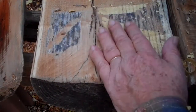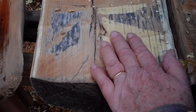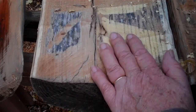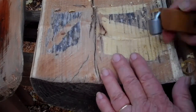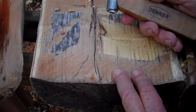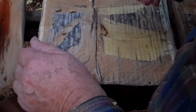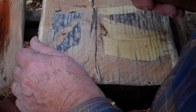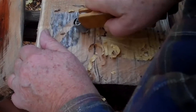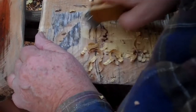Now, for hollowing out the mass of the material, I would probably use my rotary carver, but that's a power tool that can remove about a pound of wood in a minute. This hand tool will remove between 5 and 10 pounds in an hour comfortably without straining. So this tool is very efficient for smaller jobs. And it's easier to control, so you get a better job. It's basically a finishing tool.